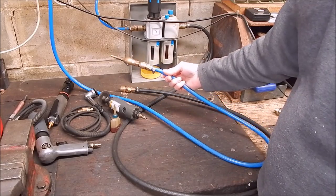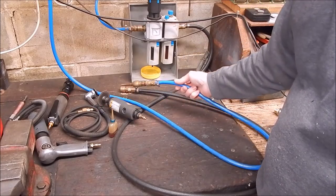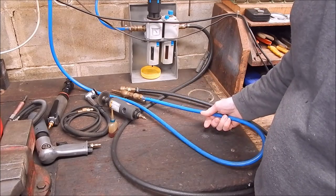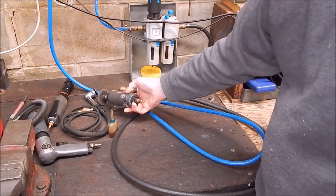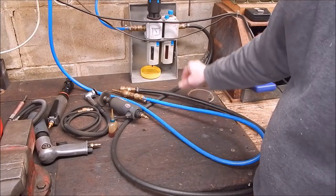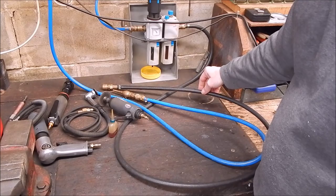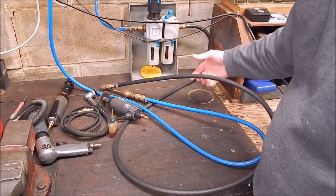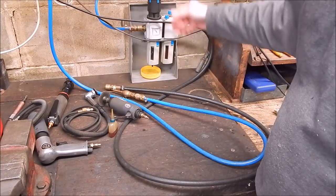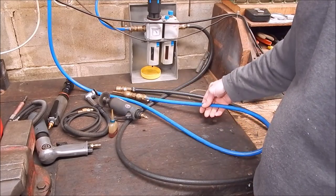Overall, the best way to go is just have a plain airline. Add a bit of oil to your air tools every so often and you're good to go — that way you can use your airline for spray painting, air dusting, everything. You're not going to contaminate the hose as you're directly oiling at the point of use. A separate oiler is handy if you can buy them cheap, but they're normally quite expensive and most useful for people using tools on a continual basis.